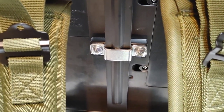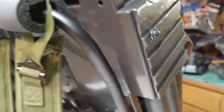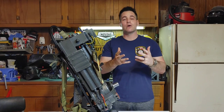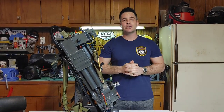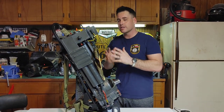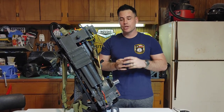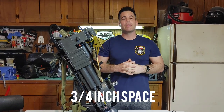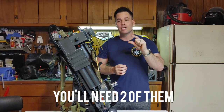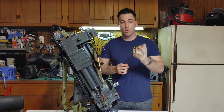If you guys are interested in purchasing one of these I will put them up on my wife's Etsy store. But you can also do this yourself — go buy some wood, shape it to how you like, just make sure that it's three quarter inches tall to get a very nice and correct gap. Just make sure you are doing a three quarter inch space and using M6 metric screws, one inch long — the equivalent of one inch is 25 millimeters.